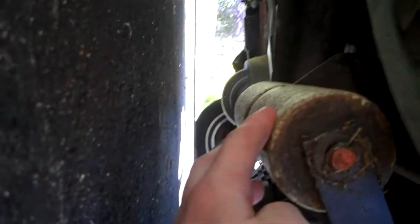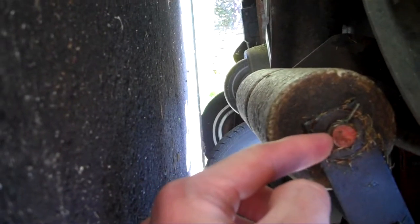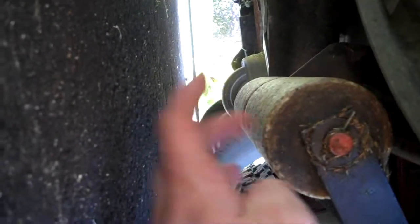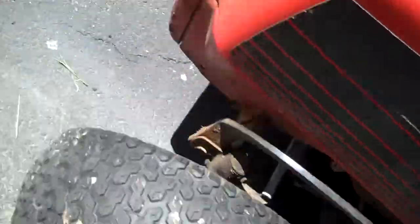Of course put a ton of grease on the boot. That one didn't spin too bad. On the height adjustment, you have two wheels back here and two rollers. These things were the loosest things in the world. So we put a new 3/8 roll steel dowel in there. We took some steel tubing and lined the inside of these, and these things are extremely solid, which is awesome. Blades were also okay, so we just sharpened all of those — those turned out alright.